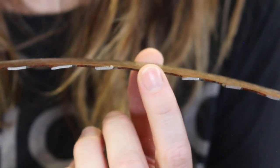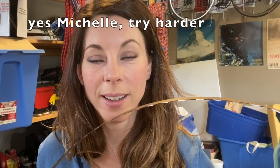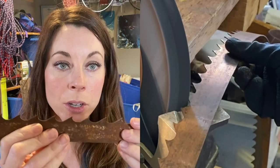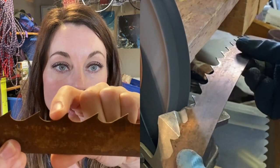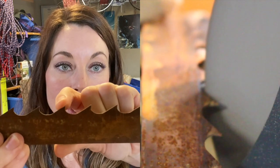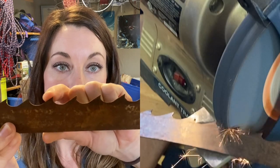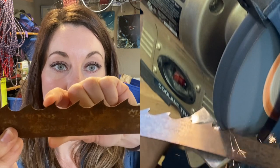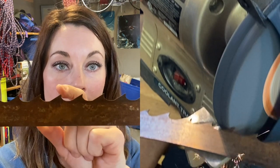The teeth that I've actually done properly are sharper, but I've missed some. I didn't quite get to the tip on some of them, and those are the ones that aren't that great, so I'll have to try harder on the next ones. I've done them all now. What I'm trying to do is just cut that surface down a little bit to get it clean, going over the tip ever so slightly — getting it ground down without nicking it, just getting a nice glide over the end and giving that tooth some bite.